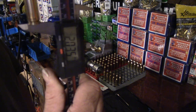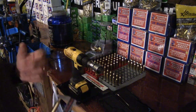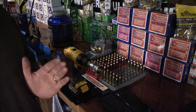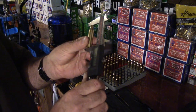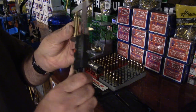I'm at 2.034 and a half. I'm there — that's what I wanted. What are your two goals? One: get it set for a particular length — we're there. The second goal: how square are you? Now let's look at that.